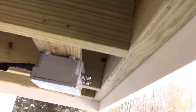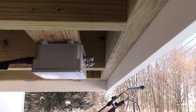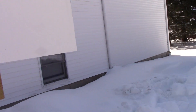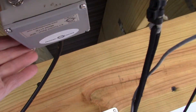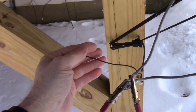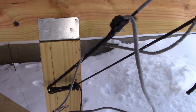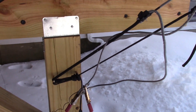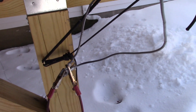I'm under the deck, and there's the balun that I used to have in series with the open wire feed, going up to the tower. What I did was I took both of those wires, put them in parallel, bypassed the balun up here, and sent it into the house on just a single strand of wire. So any losses in the balun at 600 kHz are no longer in series, which is one of the reasons why you'll see a lot more power.